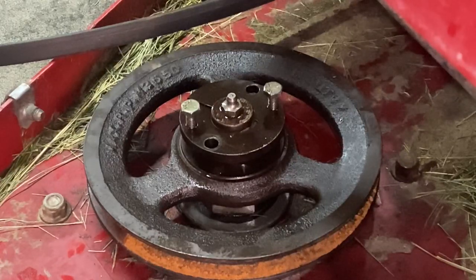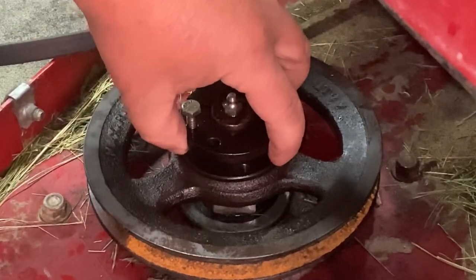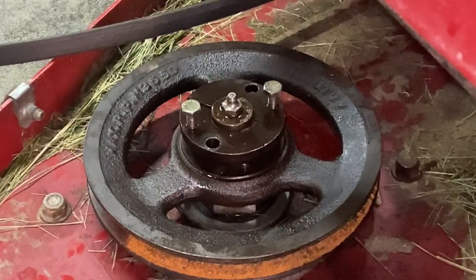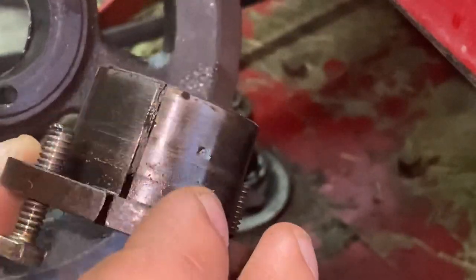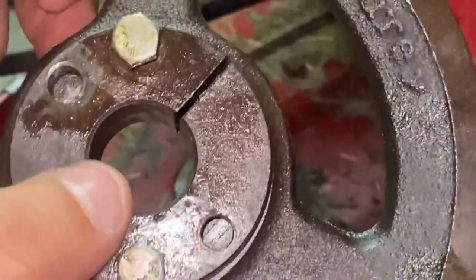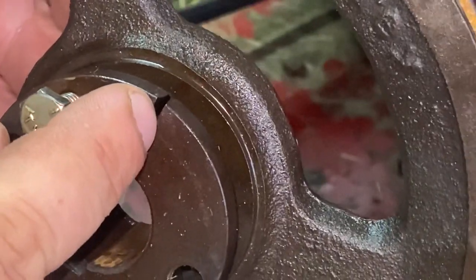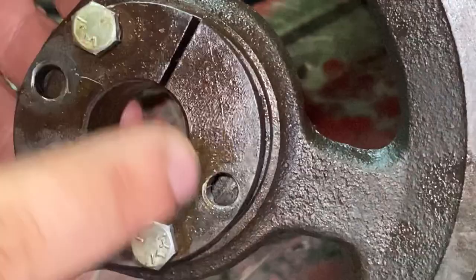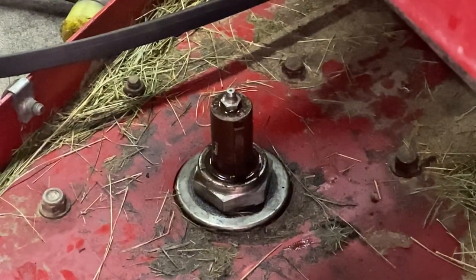A lot of these too, the pulley will be part of this — the pulley will be up above. Once you take this part out, the whole pulley will just come off. That is how you disassemble a taper lock fitting. Here's the two components — you can see there's a split in there. This is slightly tapered, and the inside of this is slightly tapered. So this fits onto the keyway on the shaft. These bolts pull these together, squishing this onto the shaft which mechanically locks it, and then the bolts hold this to this. So now I can finish getting these bearings out and that'll be a separate video. This is Adam from Small Town Machine Shop — please comment, like, and subscribe. Thanks for watching.